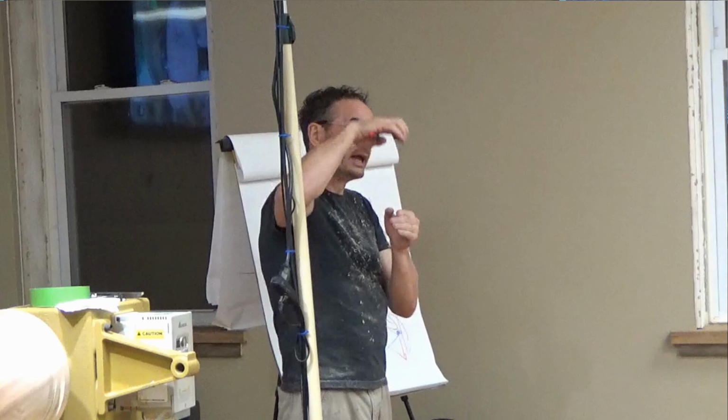So if you take a skew with a sharp edge that you've beautifully honed and you put it flat on its side into the wood, what happens to that skew edge within 3 seconds? Dull. So what's it doing to the grain? Mulching it. The burr is like wire wool glued to the front of an edge, and it's wire wooling, abrading the surface, the end grain away. It's making powder, but look at the finish. It's really nice, right off the tool. It's really good. But when the burr is gone, what is it? A dull skew. Do dull skews work? No. So if my dad ever tried it, it would never have worked.